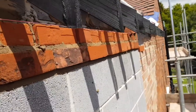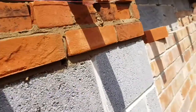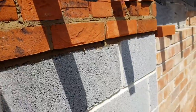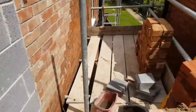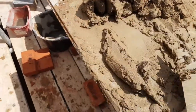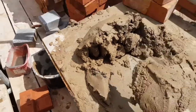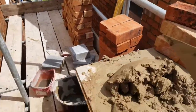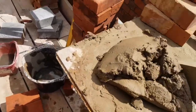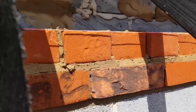That course has just gone on - bloody bore with my timbers in the way. Instead of spreading loads, what I like to do when I've got dead tricky stuff like this is use a small trowel, and then instead of getting your muck on the side of your blade like you normally do, just get a little bit on the tip - slap - there you go, and then scrape onto your brick. That's what I like to do anyway. One more course and then back on the gable for a bit of block work.